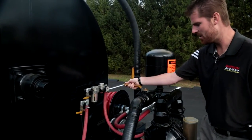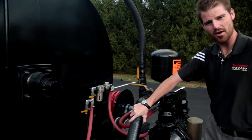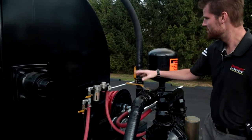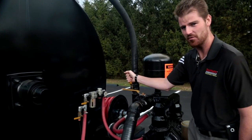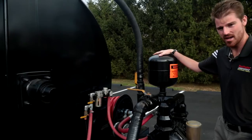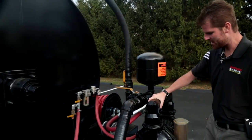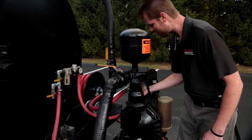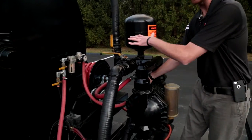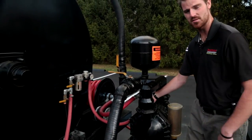Here I have my main open and close valve for material to my spray bar. This is my recirculation line back to tank and recirculation valve, domed surge tank for pulsation dampening. And here is my Gladiator 3 inch dual diaphragm pump. Underneath here is the open and close for my 75 foot hose and spray wand.